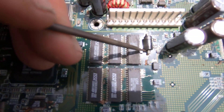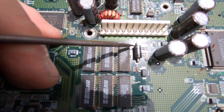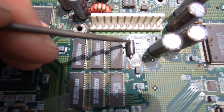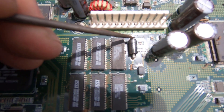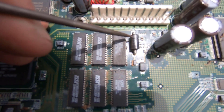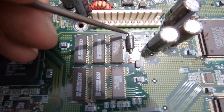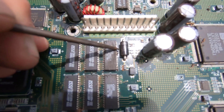Here you can see this device — this is probably also a tantalum capacitor. It's got the silver bar at one end. It is a capacitor, CR35, and the bar would just define the polarity end for the connection. I'd have to look up the part number on this one to be sure that this is, in fact, a tantalum capacitor. But they do come in cylindrical shapes.